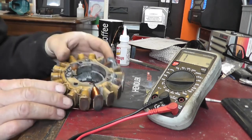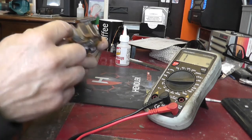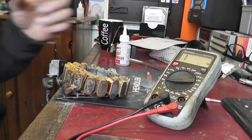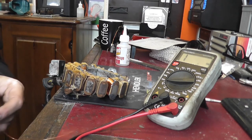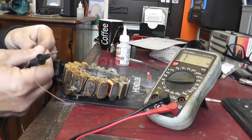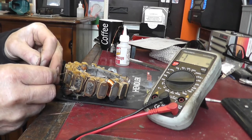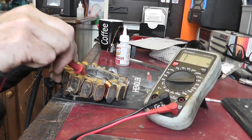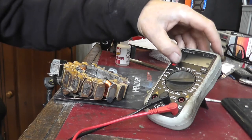Right, okay — so just to recap: that's where the wire comes in, do your turns on it clockwise looking from the top, and that's where the wire exits on the blue wire. One thing we didn't check — let's make sure we haven't got any continuity to ground. We don't want that going to ground. We've got nothing to ground, so that's not shorting to ground now — like it was before. Right, okay, we've set up in the machine to wind the two low speed coils.